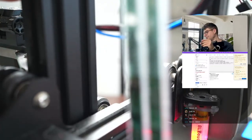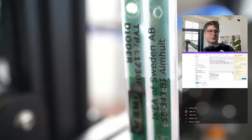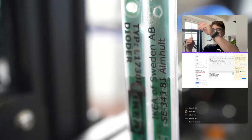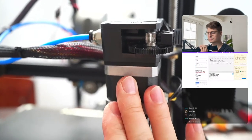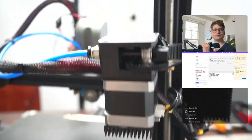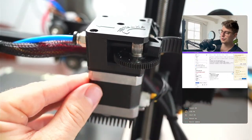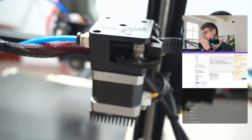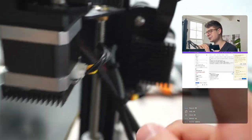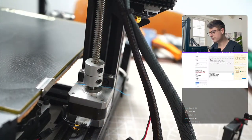Those are the parts we'll keep from the hotend. On the back we will reuse the motors. This is the Titan extruder, which will definitely go out - it's not an original one, it's a fake one. I really don't like it. The motors - I put heatsinks on them, I don't know why. This will be interesting to get off because they're glued. It's the X motor and the extruder motor. We will also reuse the X motor and the Y motor. The lead screw will go - we will be fully belted. The E stepper will also stay. Then the heated bed will of course stay.